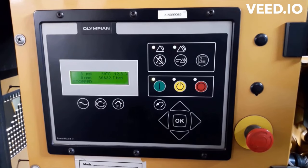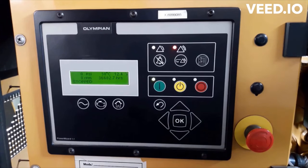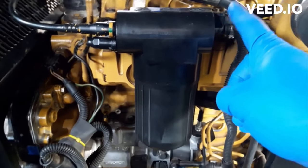As you can see, it is cranking but not starting. In this case I'm going to check the fuel shutoff solenoid, or fuel cut solenoid at the injection pump — whatever you call it in your local language, please let me know in the comment section below. Remember, the injection pump solenoid and the prime pump share the same circuits.